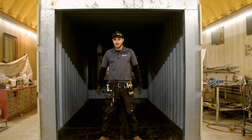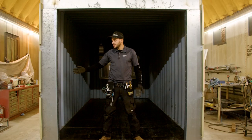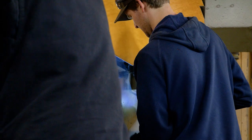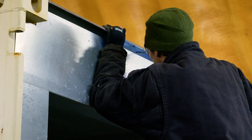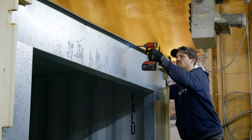For this specific framing kit, the footer basically extends the footer in the container doorway and continues that angle. The side pieces self-tapping screw into the hollow section of the corner post. And then the header itself has its own little rain drip that runs the water away from the container. The self-tapping screws need to be installed way up high, out of the way of the roll of this roll shutter door.